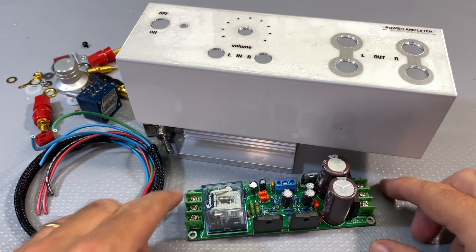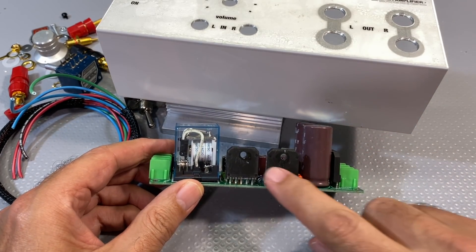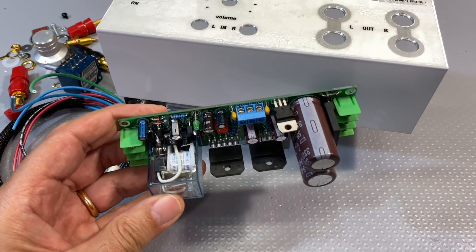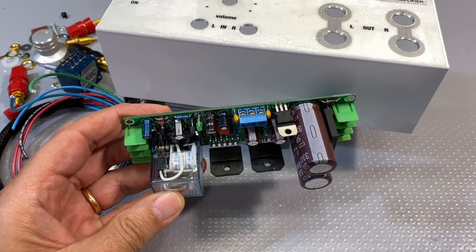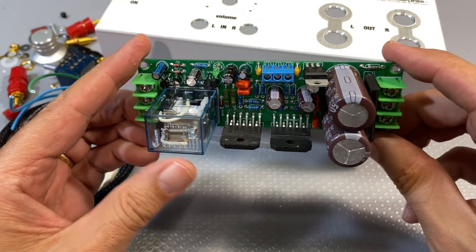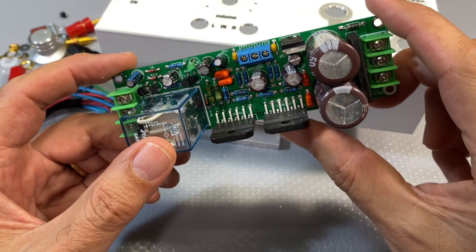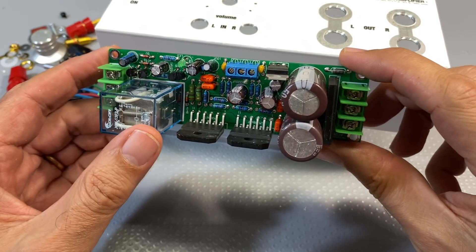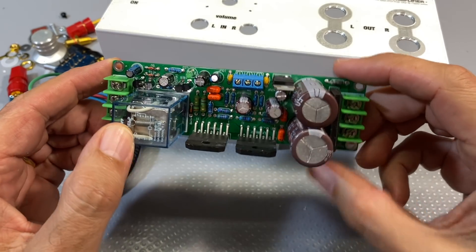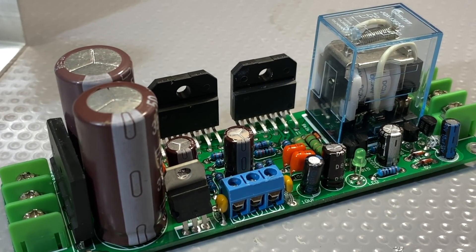I looked for a chip amp. If you don't know what a chip amp is, it's basically an amplifier in a chip. I prefer these linear ones - the LM series. I previously built an LM3875 and I was very, very happy with it. It's about 50 watts and it really couldn't get any simpler. The chip amp does all the work and you just have a few extra components. This one's got more than most - it's got speaker protection and a filter supply already on board, making it very easy to build my workshop amplifier.